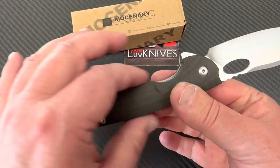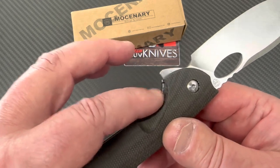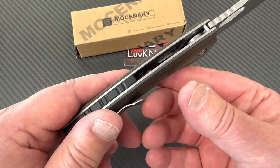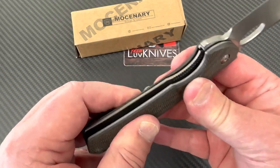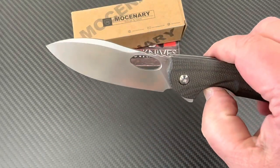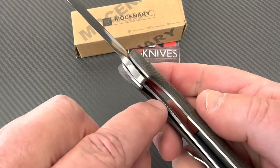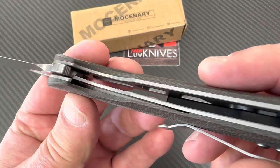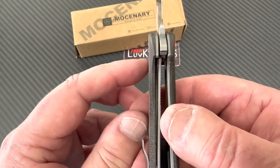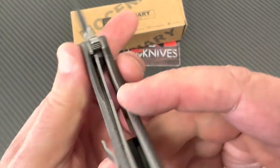You've got contoured micarta scales with a G10 back spacer. The pocket clip works pretty well because it comes down, then it comes up and kind of flattens out, so it doesn't stick up and bother your hand when you're holding the knife. The ergos are just straightforward. Can I disengage the lock bar? They're not nested liners - they're right loud and proud, so it gives it a lot of structural toughness. Nested liners are usually a thinner gauge, but this is going to be pretty solid for a liner lock.